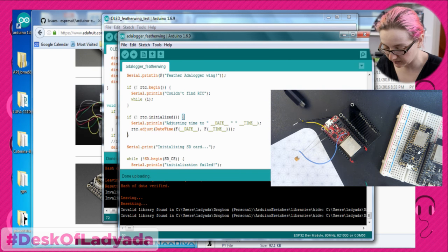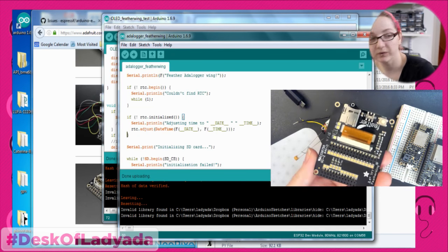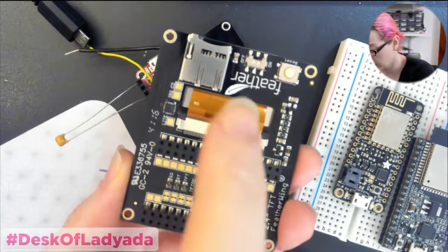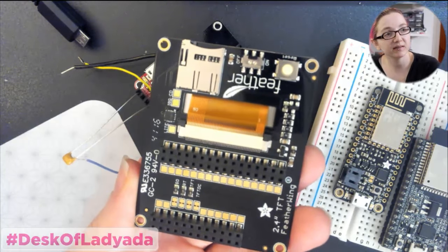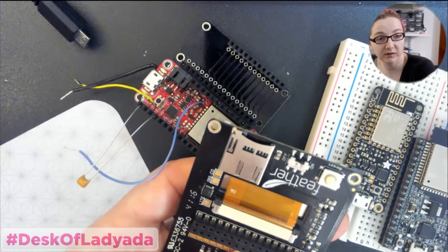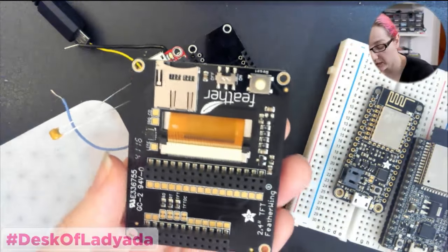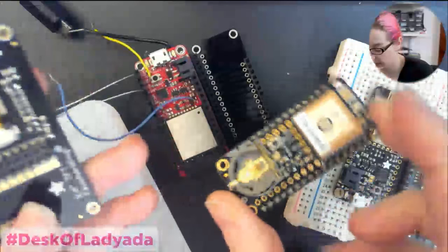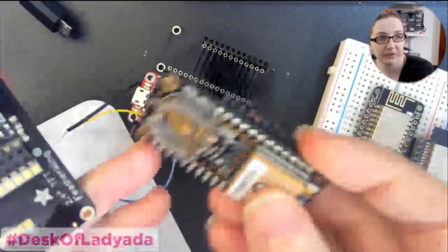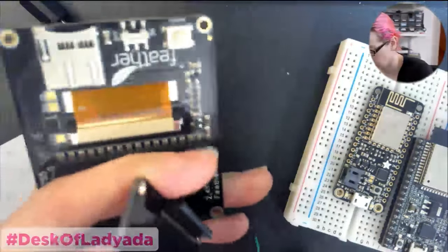We're running out of time, so let's wrap it up with the TFT Feather. Okay, so the TFT Feather, this is epic and it's huge. What's really cool is it's got a lot going on: an SPI TFT, an SPI SD card, and an SPI touchscreen. We tested I2C through multiple chipsets, the real-time clock, the Charlie Wing display, and the quad alphanumeric display. When we get the new version of the Feather, I'll test the GPS. Right now the UART is the main UART on these two pins, and that'll cause problems, so there's no point in testing it. There's no way it's going to work. So let's extract this from here.